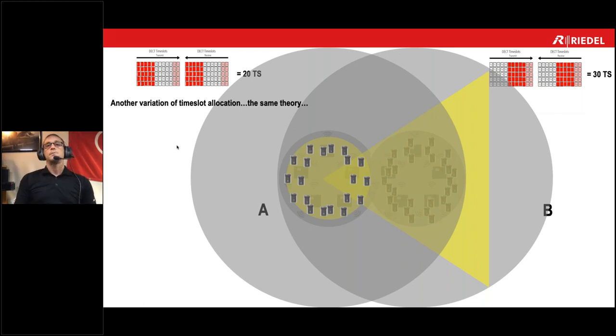Frequency coordination can now be as simple as an Excel sheet. How many belt packs are you using today? How many belt packs are you using? Because it's the same thing, right? We're allocating time slots and we're making sure that we don't get that magic number when we're overlapped. And I caveat overlapped here because you're seeing we can properly space things out.